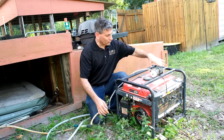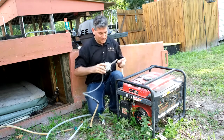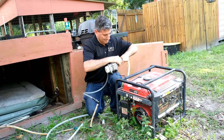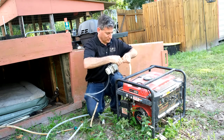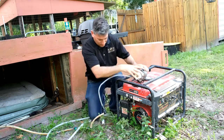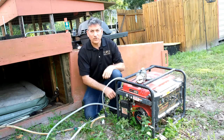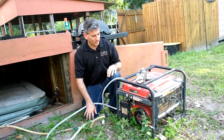That pipe then goes into an aquarium pump — a 20-watt aquarium pump. The aquarium pump is plugged in to a snorkel that we got from US Carburation in West Virginia. It costs about $200. It's a tri-fuel kit that enables your generator to run on gasoline, propane, natural gas, or in our case, biogas. It's really a quadra-fuel kit in our case.